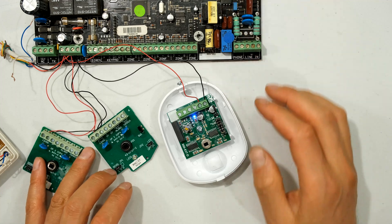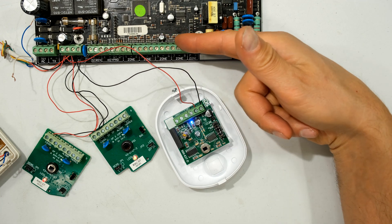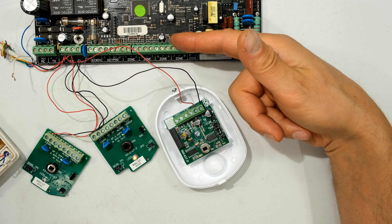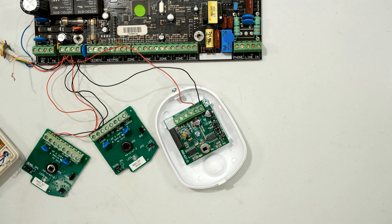You can definitely see the relay on the working unit. This was a very difficult fault to trace because even looking at the sensors they appear to be working. Measuring at the alarm panel shows a voltage present, and when there's voltage present one doesn't suspect the sensor is faulty - but in this case the sensor was faulty. I hope that was helpful for your alarm installations. Thanks for watching.